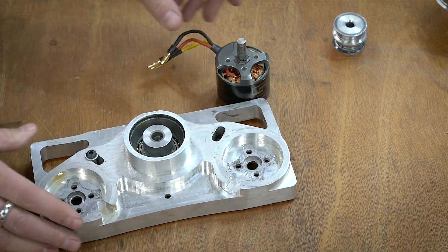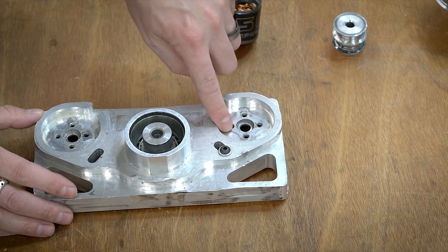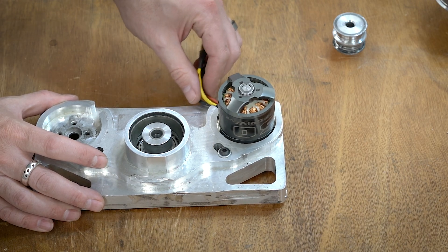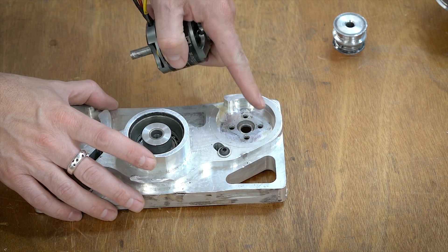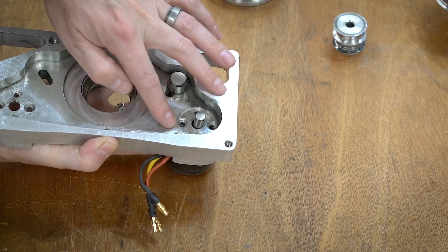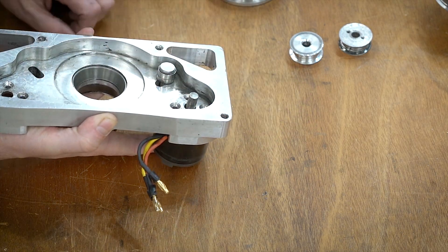The other thing I'm doing is this is a flat smooth face, and you can see the indent pattern of the motor on both of these. I'm going to machine in probably 50 thou — a pocket that the motor sits on — so the motor doesn't twist. It rattles and twists in there a little bit when it starts getting loose. A 50-thou pocket will allow it to seat tightly, it shouldn't rotate or wobble, and then the larger fasteners will hopefully keep this in place so I won't have issues with the pulleys galling.